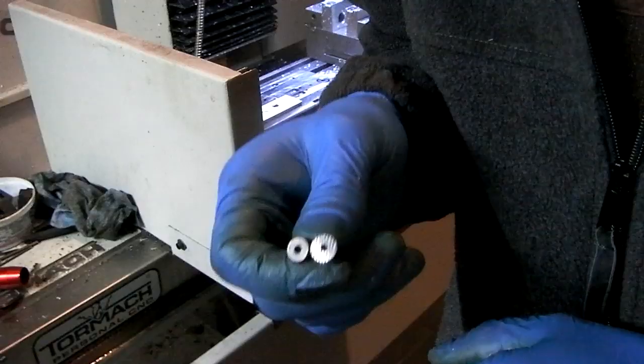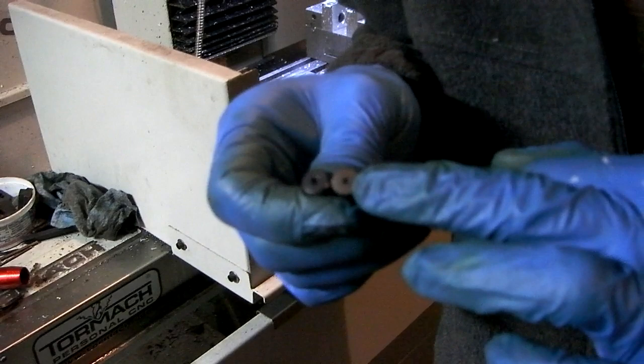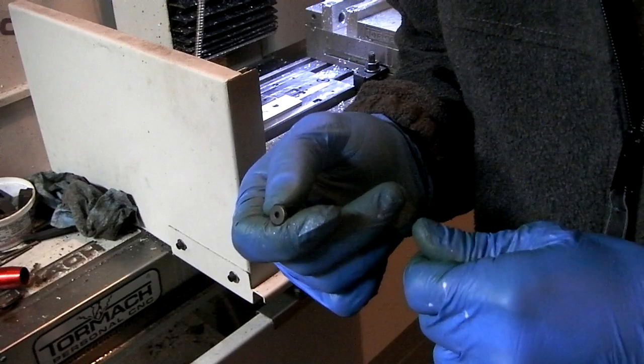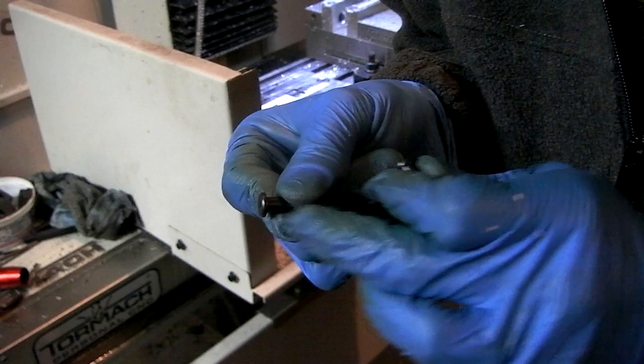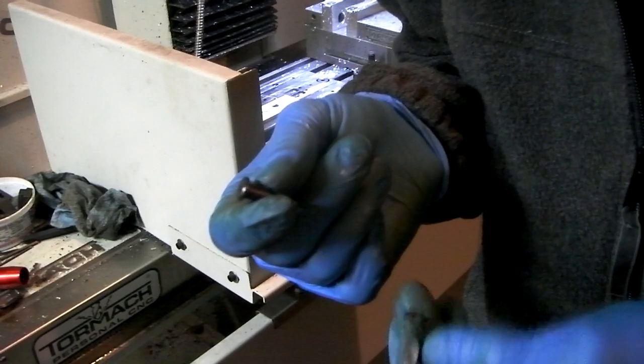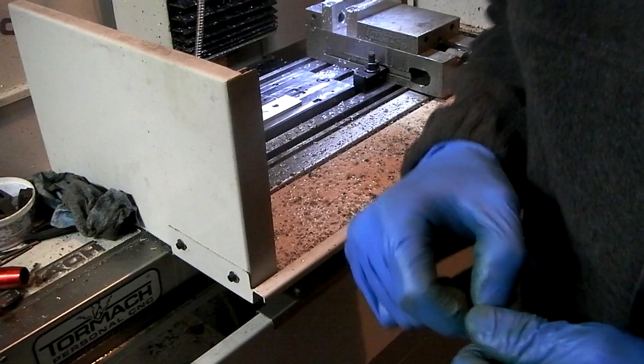So I did finally figure out why this first set of bolts got chewed up so bad. When I originally designed these in CAD, I didn't actually have them in my hands yet. I was just going by the pictures on the website and the specs that they gave. For some reason, I thought the thickness of the head was 50 thousandths of an inch, but in fact, it's 75 thousandths. 25 thou difference, almost exactly what I measured before. So now that I know these are 75 thou heads, I changed my dimensions and made the pockets 25 thou deeper, and it should work all right now.